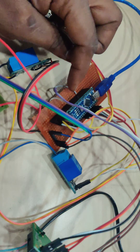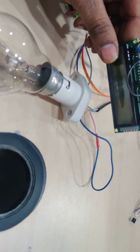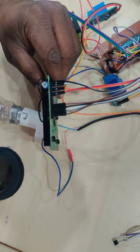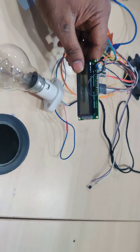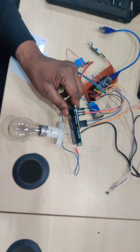This is your 16x2 LCD containing 16 pins, numbered 1 to 16. The LCD can work in two modes: 4-bit and 8-bit. Mostly with Arduino you will find examples using 4-bit mode because it requires fewer I/O pins compared to 8-bit mode.